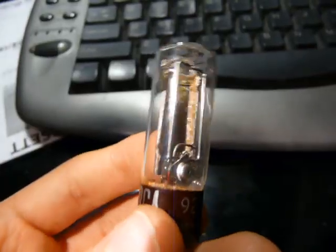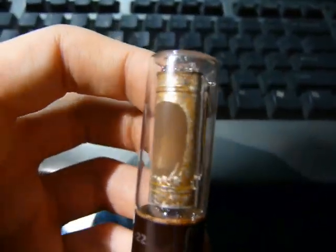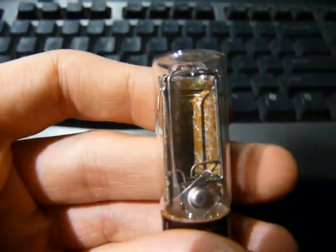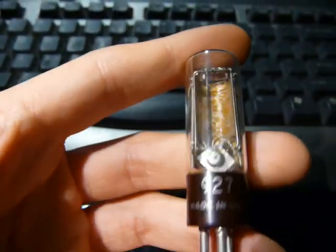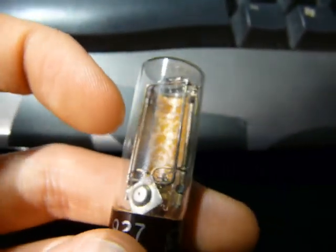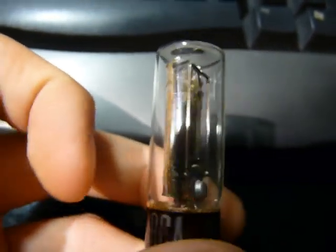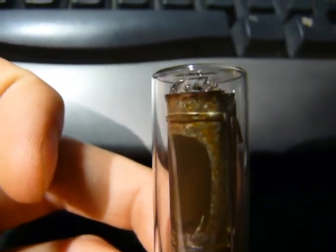More UV light — protect the eyes. And this is just a gas phototube. I don't know if that discoloration is original or if this thing has leaked. I should try it out — very simple to drive these things. Basically, these work by releasing a couple of electrons when a photon hits the plate, and those electrons are attracted to the other plate and create a current. You detect that current in the circuit, and there you go.